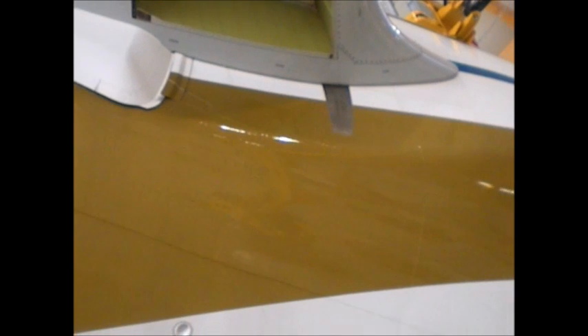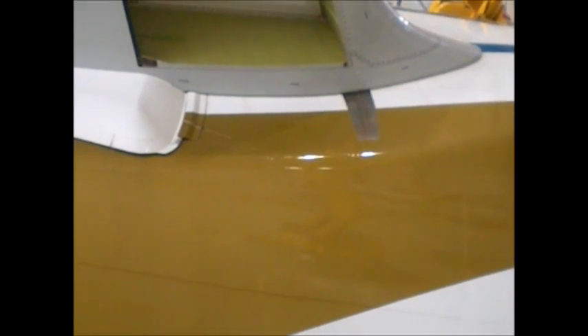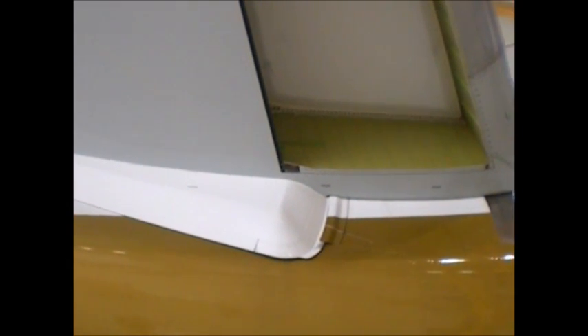This is on the outside underneath the elevator and horizontal stabilizer. Those are the close-out fairings that cover over the opening in the fuselage. This whole horizontal stabilizer moves up and down. It's all opened up now for inspections — looking for cracks, corrosion, or anything like that.